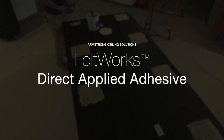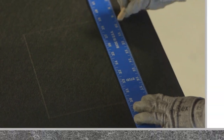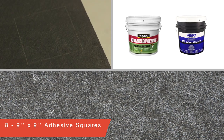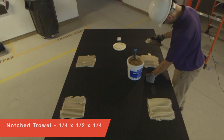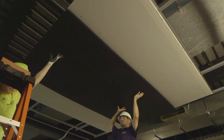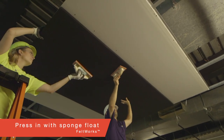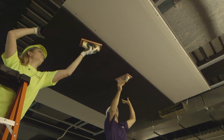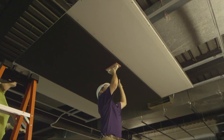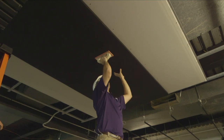Feltworx panels can also be installed directly to painted drywall. With a T-square or jig, mark off eight 9-inch by 9-inch squares for application of these approved adhesives. Use a notch trowel to apply the adhesive. Then initially press a panel into place with sponge floats. It's important to use these sponge floats since they spread out the upward pressure and eliminate the possibility of surface indentations that can occur from finger pressure. Follow up with uniform pressure at all eight locations and your installation is complete.